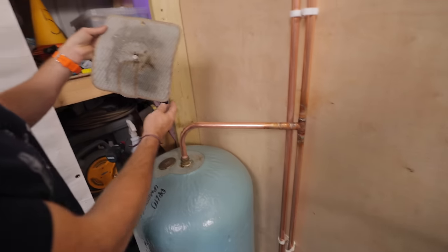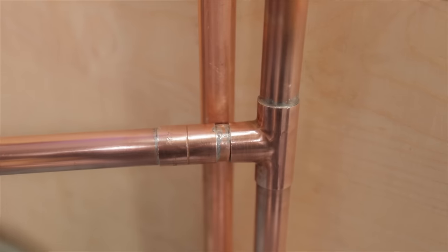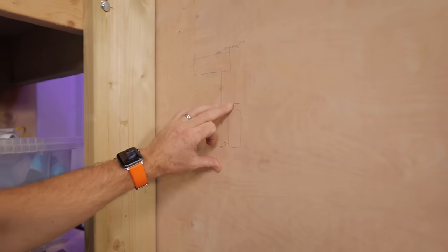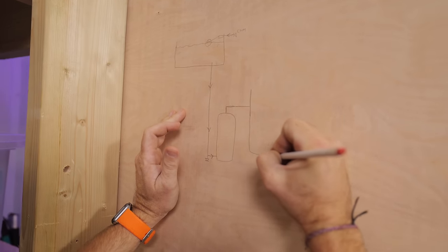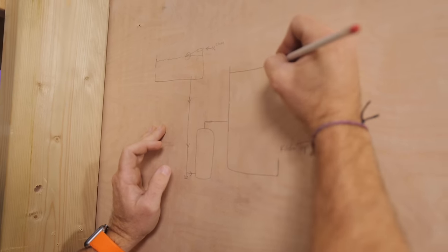Done and dusted — burnback's actually survived for once. That's how you do a nice little bit of soldering without it running down the back. We left that little diagram here and now we've got our pipe installed. It goes into a T like that, then we go down and we're feeding a kitchen tap at the bottom. Then we're going to run this up here to feed our bath tap.